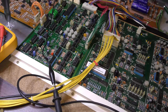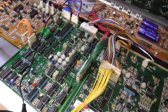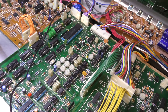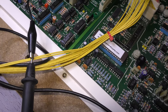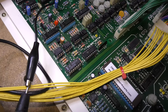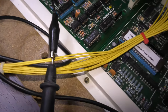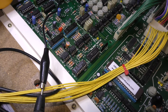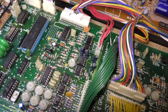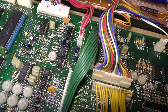While waiting for my parts for the clone board, I decided to have another go at repairing the original. I was convinced my trace work was good around the battery area and I've cleaned it up nicely. The board was still non-functional so I went through all the ICs again. I hadn't replaced the LM339N down at the bottom. I discovered that the controls for AMG weren't working - the delay and level weren't working properly - and this turned out to be the culprit. Another thing was the comparator chips - I couldn't set the DAC, and I believe it was because one of these 393 comparators was faulty, so they were changed.